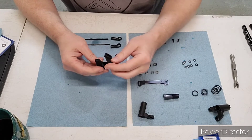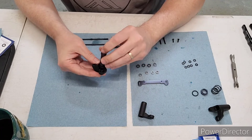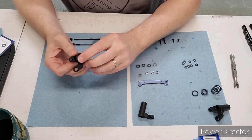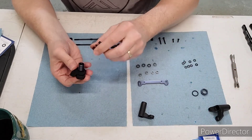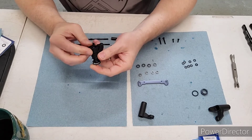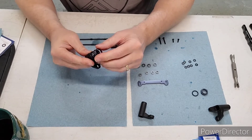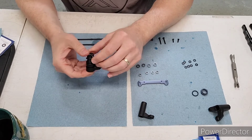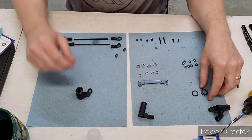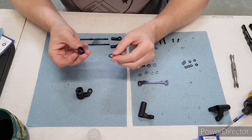You can see there's a gate in here and it goes into there, so you put that in, then you put this barrel and that nut slides right in there, and then you put this spring on. Sometimes this spring is longer than the nut and it can be tough — you might need to get a pair of pliers and compress the spring a little. So I'll try it without the pliers first.